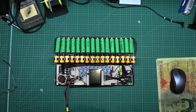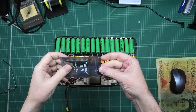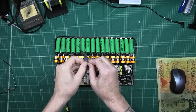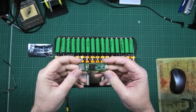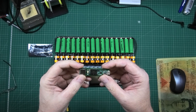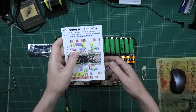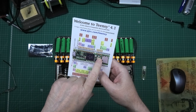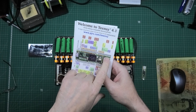After careful consideration and a bit of alcohol, I've decided that the Teensy 4.1 that's currently installed is going out. This is a Teensy 3.5, which I keep buying because they're cheap and good for projects. It has a lot more analog inputs and outputs. All the red ports on the Teensy 4.1 are analog inputs, and as you can see I've used every single one.